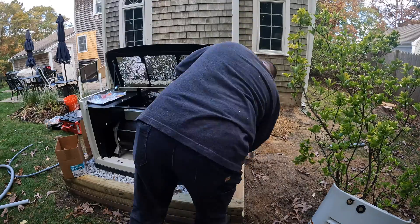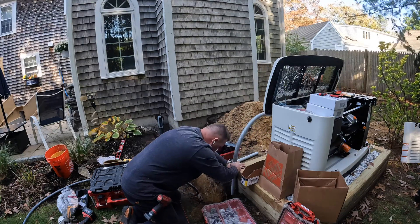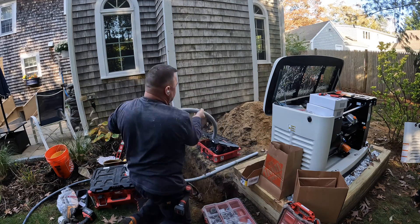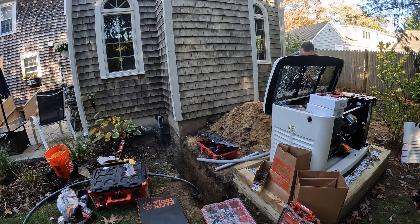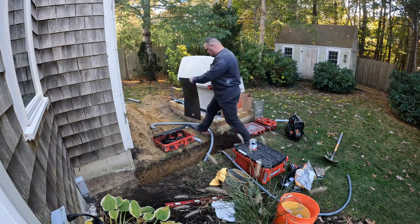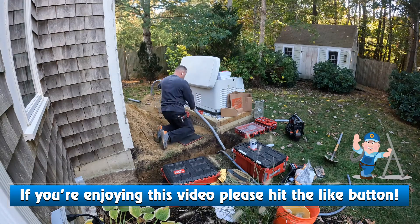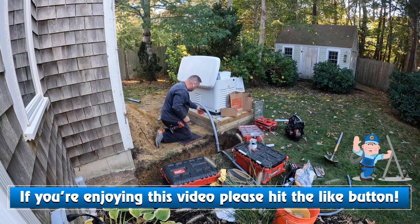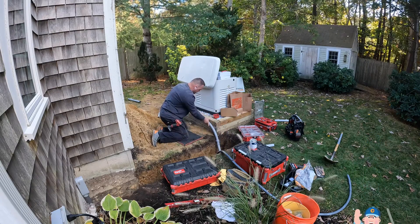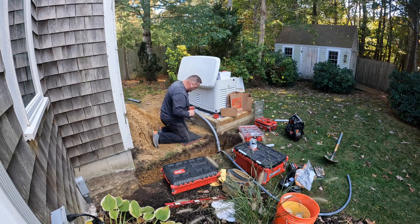I take off the front part of the generator and the side panel to access the wiring compartment. Before getting there I want to do a rough layout of how I'm going to attach this PVC and make sure everything lines up. I wish I had used 2-inch conduit going to the generator, but the opening for the wiring compartment is 1-1/4 inch, so I'd have to make another hole. I'm using 1-1/4 inch conduit here. By the time I'm done, all you see is the flexible conduit going into the earth along the back of this platform.